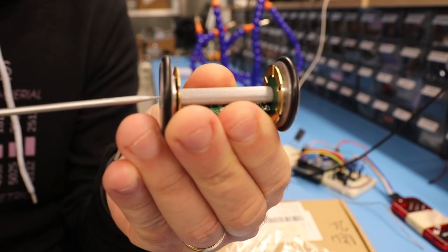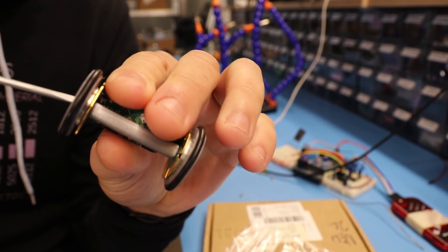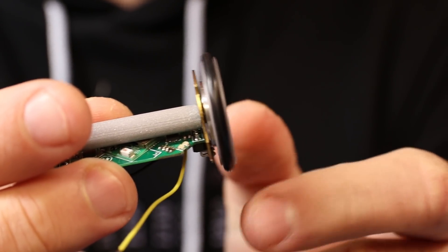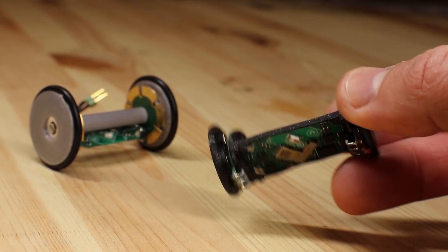I tested it with my robot. To make the robot more robust, I 3D printed a rod that holds the nuts so that the M2 bolted shaft can just screw into it. As you can see, the play amplifies with the larger area of the wheels, but it's a lot better than what I started with. In fact, the robot managed to move much better.